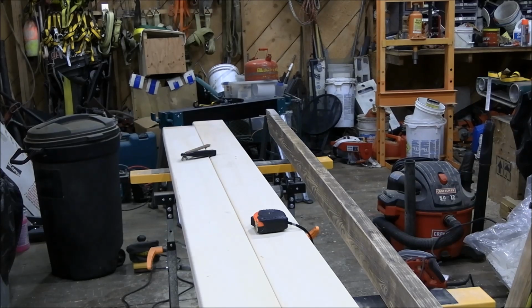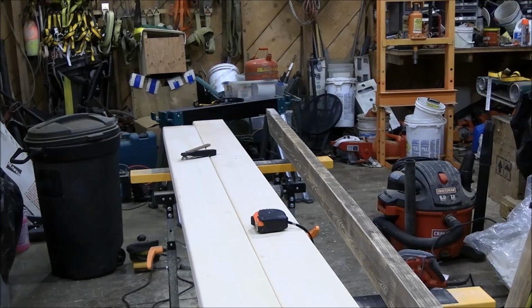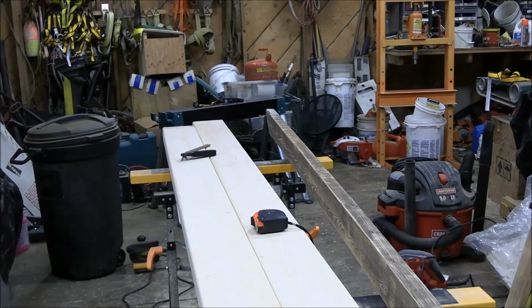On the upper end, I've got 3/4 inch plywood backing the wall there behind the sheetrock, and then going into studs. As they come on down the wall, there's just 2 studs with nothing into them, so they're just going into 3 studs, one on this end, one in the middle, and one on the upper end, and then a little bit of plywood there as it comes through the upper wall. So I'll go stick this in, and then we'll see where we go from there.